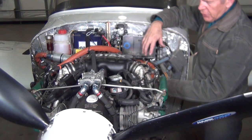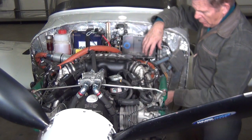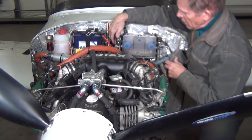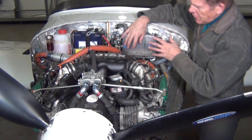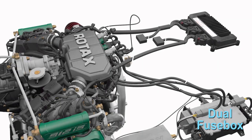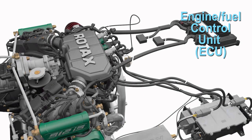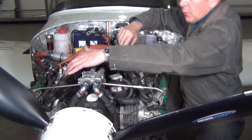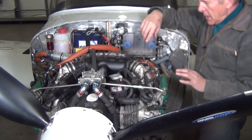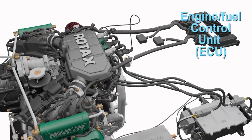And as far as the other part of the electrical system here, just like your regular carburetor engine, you've got your mags, generators down here — those come in here up to two separate voltage regulators. Those voltage regulators come into our fuse boxes. This fuse box is actually two separate fuse boxes within one. And we can see all of our wires right here go through the firewall into our engine control unit, which is inside of here — it's a little box like that. So there are your fuel system differences and electrical system differences, all controlled by our engine control unit.